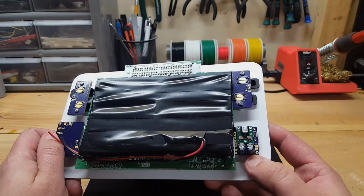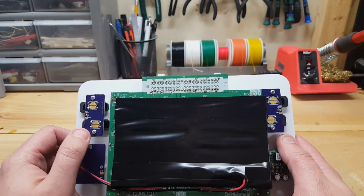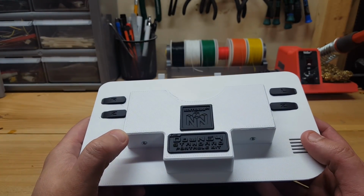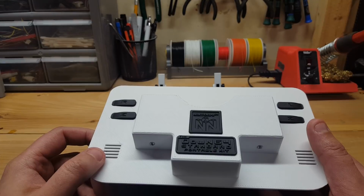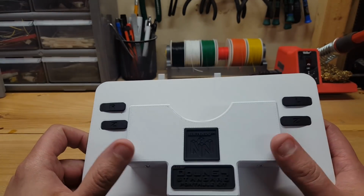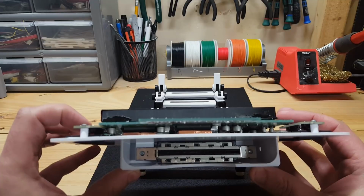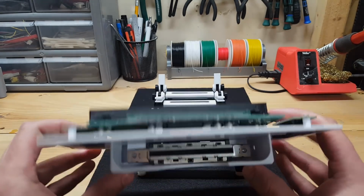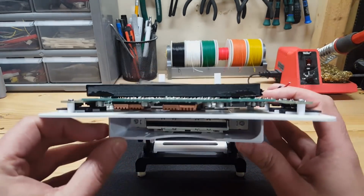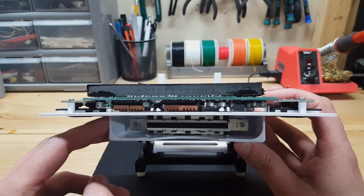And this is the 3.3 volt regulator breakout board, the R L and Z breakout boards, or TAC boards I should say. And then on the back we've got the SLA printed buttons and decals. N64 standard cart cover, which comes separate from that, but it screws right into the brackets that hold the actual cart cover in place. And this cart cover has been redesigned with curvature and hold downs right here that hold the cart tighter to the cart slot to avoid it moving around a bit.